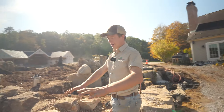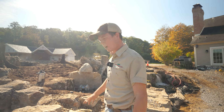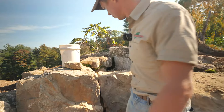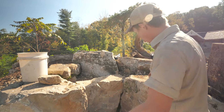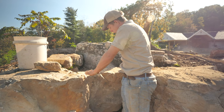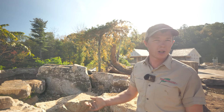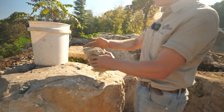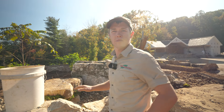Here's one that's completely finished. This is a pretty complex one — we have spillways going here and here, and this one involves five framing boulders. For your first one, if you want something simpler that also looks nice, just do framing boulder, framing boulder, spillway rock. This guy wanted one nice big tall sheet falls — just a curtain of water coming over — very simple to do and it looks good. He just found a rock with a nice edge, set it up on end, wedged it in between, and you're good to go. All of these styles can be mimicked on a much, much smaller scale — I've built tiny water features in a bowl with rocks this size.